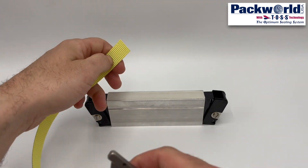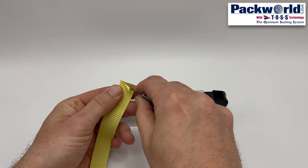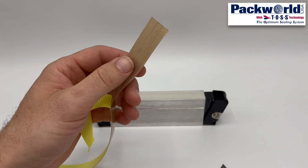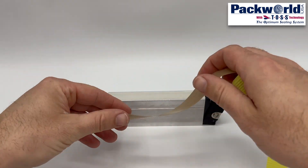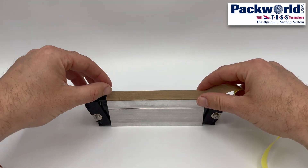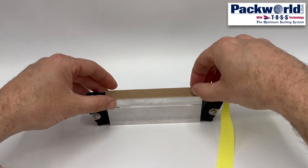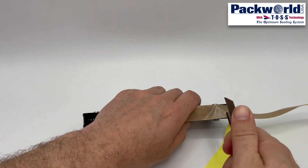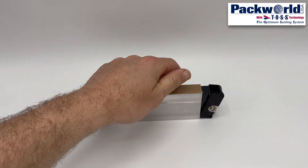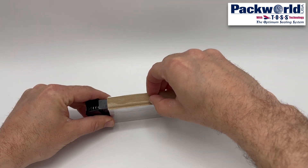The next step is to install a layer of tape over top of the insulation layer — in this example, a commonly used PTFE coated tape. After the liner is peeled back to reveal the adhesive layer, the tape can be applied to the jaw bar. Fingers can be used as a guide to properly line up the tape. Light pressure can be used to help the tape adhere, being conscious to not deform the silicone underneath. Excess tape can be trimmed away, and then firm pressure can be used to adhere the tape to the aluminum jaw bar, while being careful not to distort the silicone.